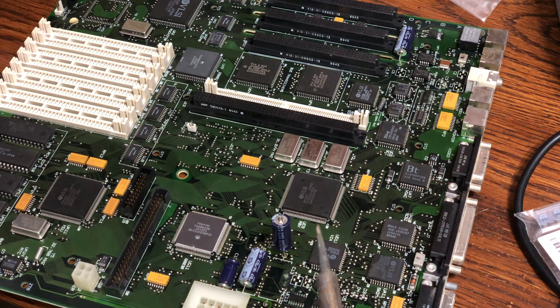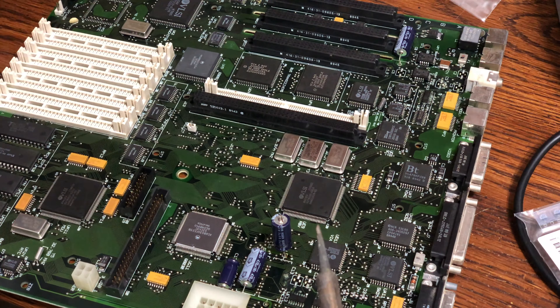Let's do this set of capacitors — the power turn-on circuitry. These are the chips that often seem to not survive the acid. I'll do my best to clean these up. Get this capacitor that was near the power switch. The fumes from this alcohol are pretty potent. I'm going to take this out to the garage and use my air compressor to blow the bulk of the water off, and then I'll leave it to dry overnight before we solder it back together.